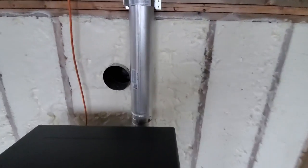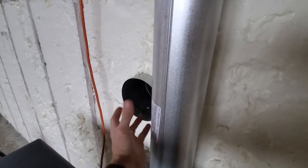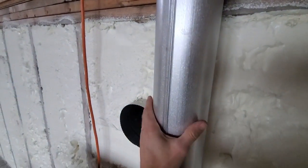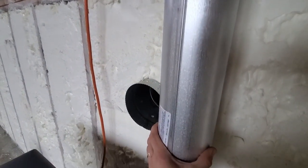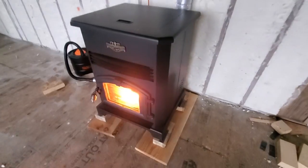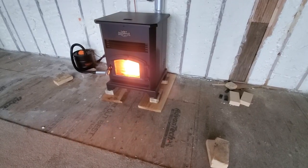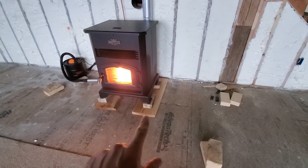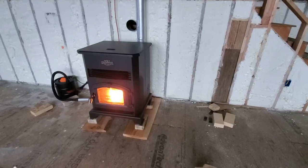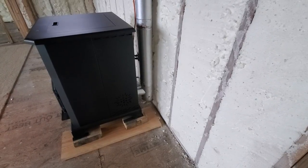One thought I have is that since this pipe does get warm over time, I could have a fan suck up from the chimney space or attic space and pull it down through — that pipe warmth actually becomes the heating element at that point. We're going to build a mantle around this, basically a two-by-four with three-quarter-inch ply on top as a hearth, with sides on the mantle. I need to be able to get into the back to clean out the cap at the bottom — I just checked it after burning six or seven bags and there was nothing in there at all.